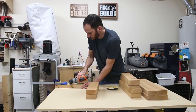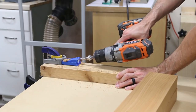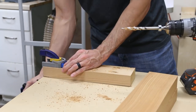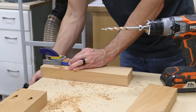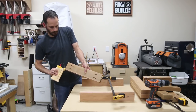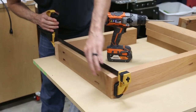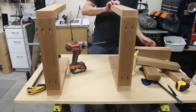Keeping with the minimalist theme, I decided to use the handheld pocket hole jig for the joints. You can pick one up for about 40 bucks, and while it's a little slower than larger models it gets the job done just as well. All these boards except the upright legs get pocket holes on each end. Assembly is very straightforward and goes really quick. I used glue and two-and-a-half inch exterior screws for each joint, starting by making two U-shaped assemblies which will be the sides without the top pieces.